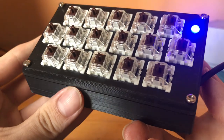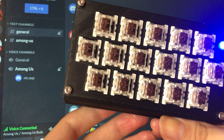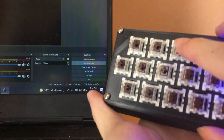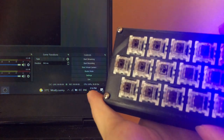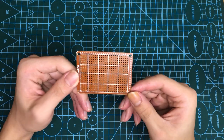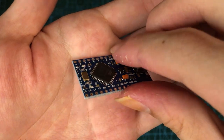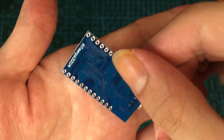So what exactly is a macro keyboard? Basically, a macro keyboard allows you to perform shortcuts with a single key instead of a sequence of keys. Today I'm going to show you how I built and programmed one for my friend Ben to use as a stream deck. For this project, I'm going to be using some mechanical switches, 10k ohm resistors, a PCB, some jumper wires, and a Pro Micro board which uses the ATmega32U4 chip. With this chip, our project can act as a HID — Human Interface Device — when connected by USB. Your mouse and keyboard are examples of it.